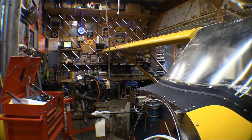There's a pretty good reason for doing that. If the wing is perfectly flat and straight, it would be more efficient. You might think that by decreasing the angle of attack of the outboard section of the wing, it would lengthen your takeoff roll, and it does to a degree, but the positive effects outweigh the negative effects.